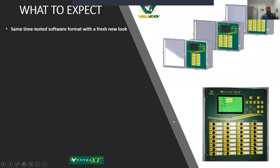It really is just an improvement and a step up from the Ventra Pro, but the same core logic handles the ventilation, interlocks, and all the abilities to take data from the inputs and convert that to really good air and ventilation in the barns for the animals we're raising. The menu guide and headings are the same — output channels, control set points, minimum vent, and purge settings — just presented in a much easier format than the old 2x40 line display of the Ventra Pro.